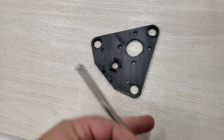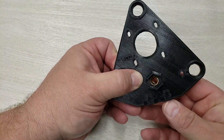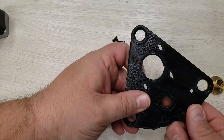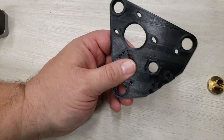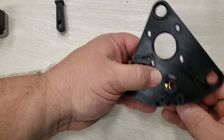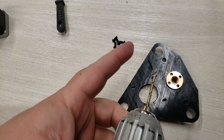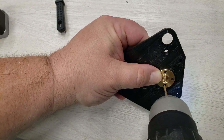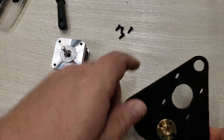We're going to go ahead and use one of these lead screw rods. The problem is that this is just a hair short on fit, so we're going to see if we can file out enough of this. Then we'll drill holes here to hold it in place. I took the drill and opened it up just a hair more, then hit it again with a file. Now it fits perfectly. This here is a 2.5mm bit — slightly smaller than a 3mm — so the threads have something to bite into with the plastic. Because I used that M2.5, it's gripping right into the plastic very well.